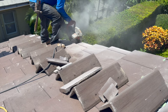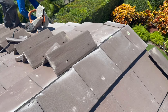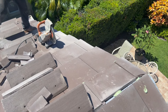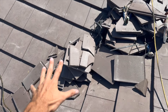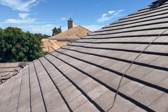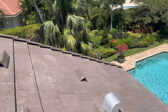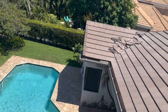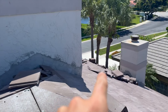Shaving the edge of the tiles here for the rake tiles to go on. You see all the pieces you have to cut when you're doing mitered style — you end up with a lot more waste, but you get that nice Bermuda pyramid style finish on the hips and the ridges. There are the rake tiles actually installed right here, prior to doing the concrete.